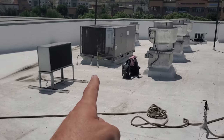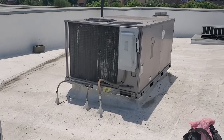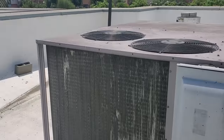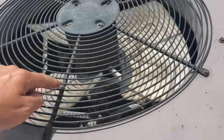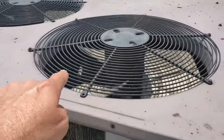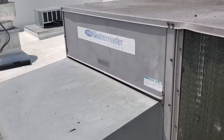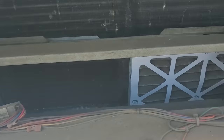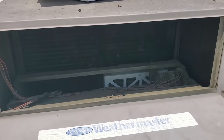I'm going to start on the unit I was called for, the kitchen, and see what we can figure out. It's probably close to 90 degrees outside. And you can see that's ice all over the suction line — there's a big old ball of ice. I bet this guy's iced up. Let's open this up and see what's going on. There's a little bit of ice, but I don't feel any air movement, so I don't think the indoor blower motor is running.